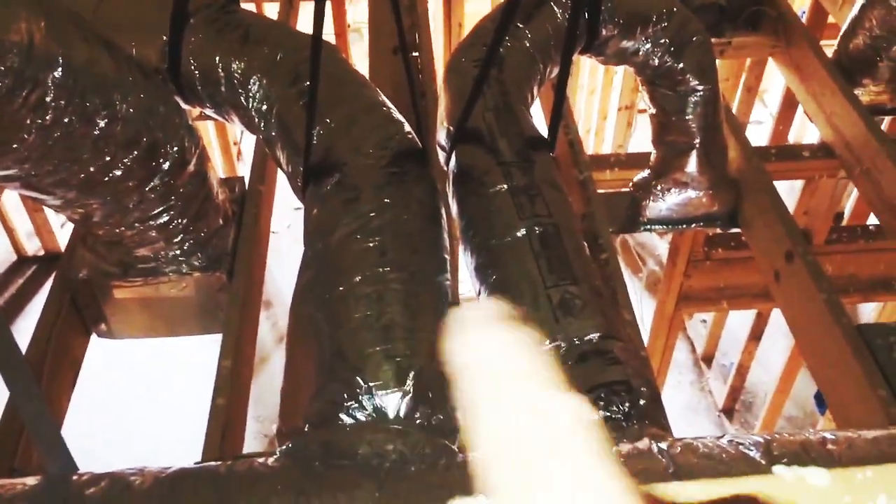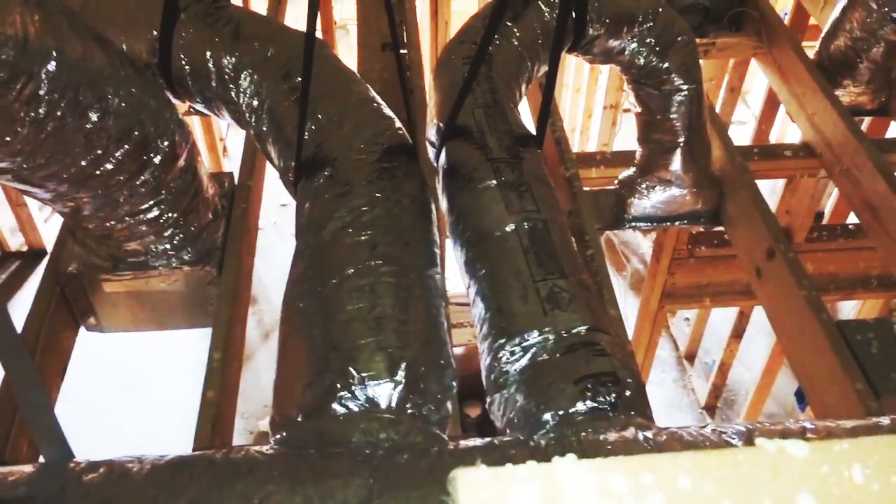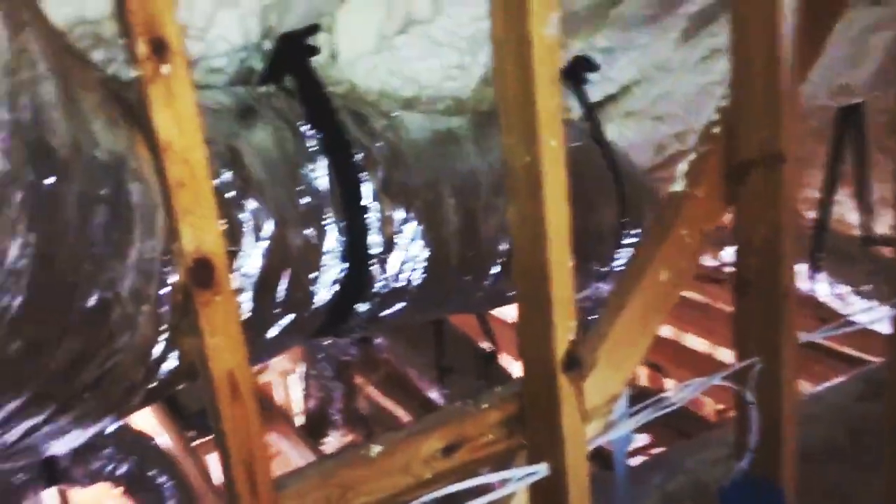Everything, as far as run-outs, you can see these right here. All of them have balancing dampers right here on the top, that you can reach down through the insulation and grab. There's the return boxes. Everything's R8 thickness. It's one of the returns coming up through here.